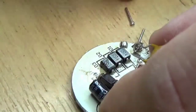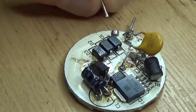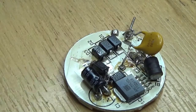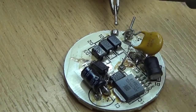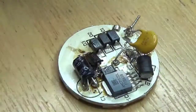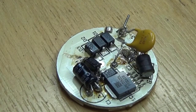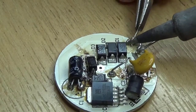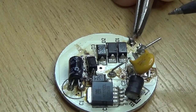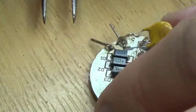Always check what you're doing, because you only get a limited number of chances. The more you take things off and put them back on again, the glue that holds the PCB tracks and pads to the circuit board starts going, and the pads start lifting — and then you're probably looking at a failed PCB.